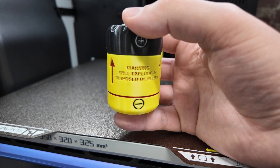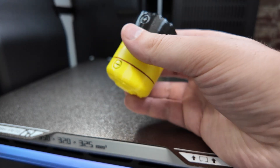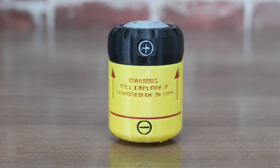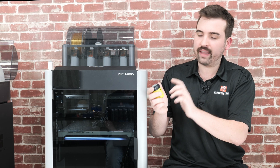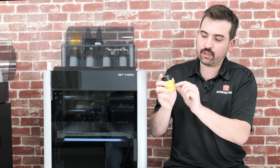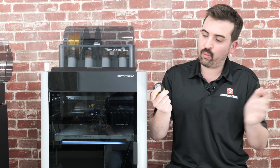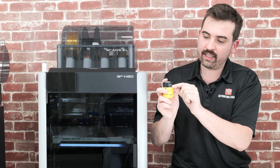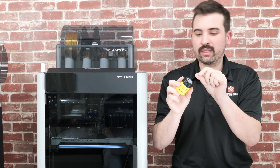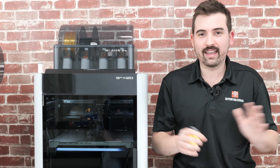That's because you can load up one filament on the left extruder and then the AMS on the right — or if you have multiple AMS units, you could do an AMS on both. The way I set this one up is I put yellow on the left extruder and the AMS with the rest of the colors on the right, because there were the most color changes between yellow and the other filaments. So instead of switching colors every single layer, it just switched between the nozzles, which saved so much filament. The most waste was produced once I got past the yellow and hit white and black, and then it just had to do one more switch to finish with gray. It is so nice to not waste twice the total amount of filament just to do multicolor prints.